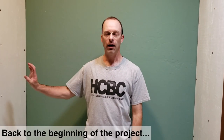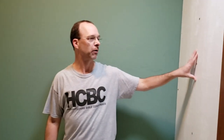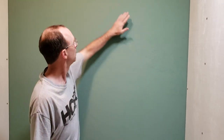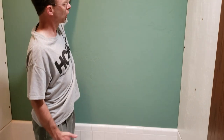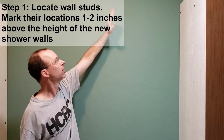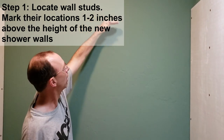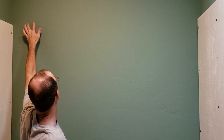I've got the plywood on both walls. The walls were an inch and a half wider than the shower insert, so I've got a three-quarter inch piece of plywood on each side. The next thing you need to do is mark the height of where your shower inserts are going to go. I've already marked that. Find where your studs are using a stud finder, and mark them with pencil so you know where they are when you bring the shower inserts in.